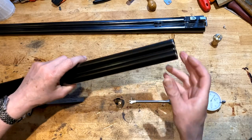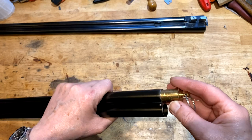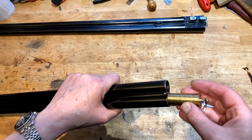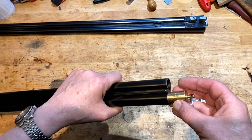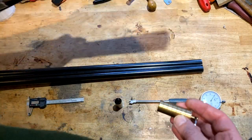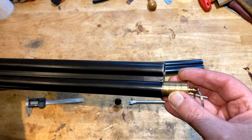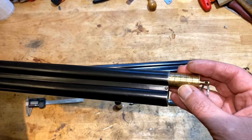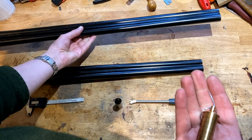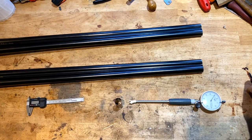So while I can use this as a demonstrator, it shows that that's half and that's quarter, which I do agree with. These are nominal sizes. So that's quarter and half. They're a guide only, but when it comes down to using them for reaming, I wouldn't recommend it, because they're vastly out of dimension.